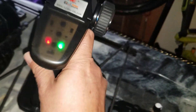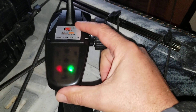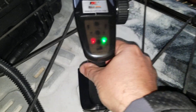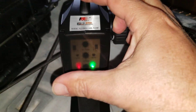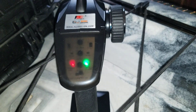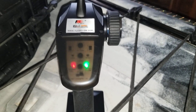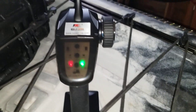The radio in this thing is only this big — all the rest is just handle and plastic, with a battery in the bottom. So I'm going to crack this open, pull out that radio, desolder the spring-loaded pot, solder in a dial pot, and put this little piece in a cell phone case or something similar. That way I'll have a tiny little remote control device that fits back in my PFD pocket, but with a dial pot I can set and leave when I just want to run at a constant speed. That's the plan — we'll see how it goes.